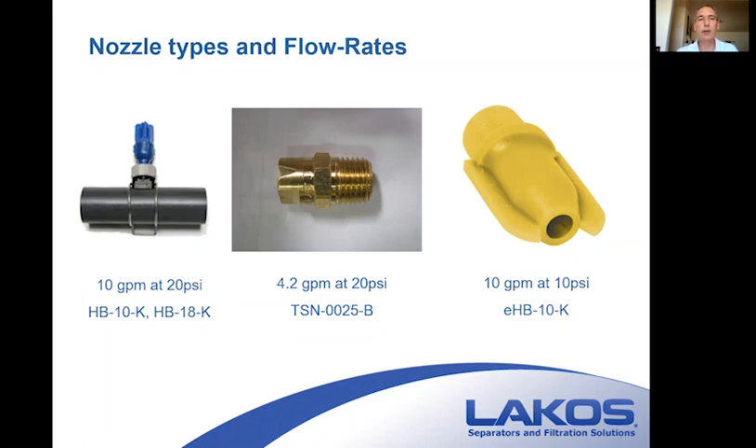Each factory should work with you to get the yellow or blue nozzles installed if you're getting factory-installed piping. Marley uses the same flow and size nozzle but in plastic. Evapco uses brass. BAC, from what I recall, uses either the blue or yellow hydro booster — not the quarter-inch brass or plastic spray nozzles. The color difference primarily dictates between your E-Series and your standard old TC Series package systems.